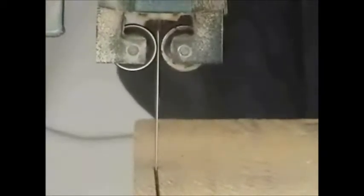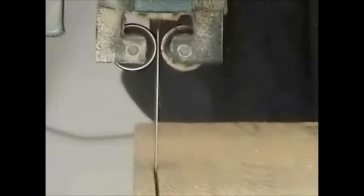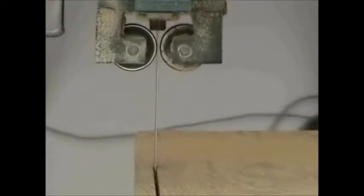It's correcting itself because it can, and the blade's path of least resistance is between the top and bottom wheels with a lot of tension in between. So if you're having a hard time getting straight cuts, look at your blade's set angle, not the guides.